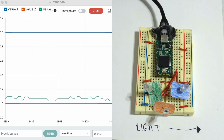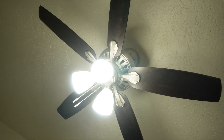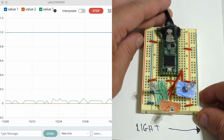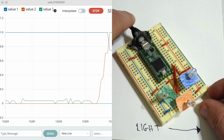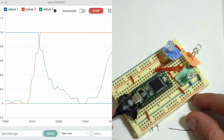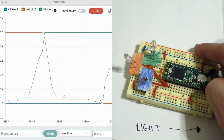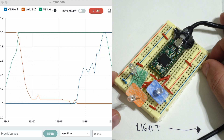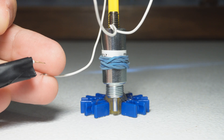Just for testing, I connected three photo transistors to a microcontroller and plotted the brightness of each one scaled between zero and one. The scene is pretty evenly lit but the light source is up to one side, so the blue-labeled sensor pointing right at the light shows the highest blue line in the plot. Rotating the whole assembly causes the orange line to fade in while blue fades out, then green fades in as orange fades out, and all the way around back to blue. That actually works better than I thought — it gives a reasonable approximation of where the light is relative to the robot.